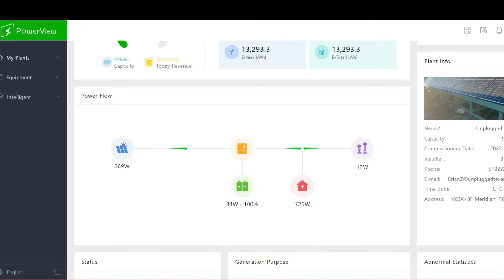If I turned on a bunch of loads right now, the solar panels would immediately start bringing in more energy. But right now it's basically dumping excess energy I don't need, which is why I need to make my battery bank a lot bigger, or find some sort of dump load. This happens nearly every day unless there's a storm or really heavy overcast — and even on heavy overcast days I can still get probably 50-60% charge on my batteries.